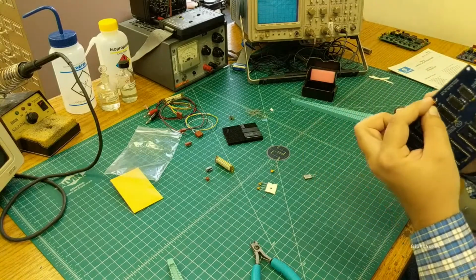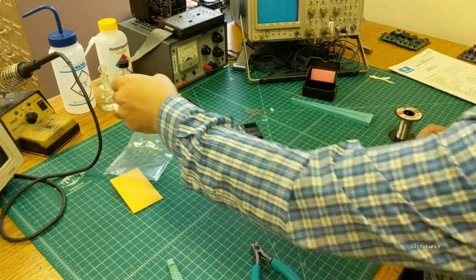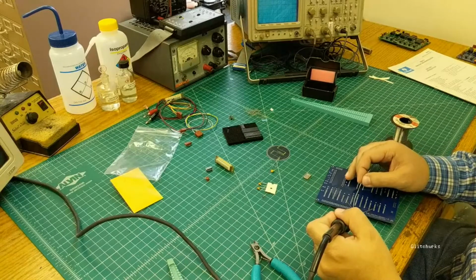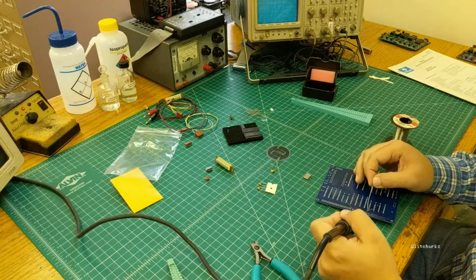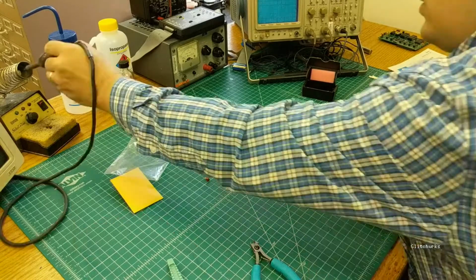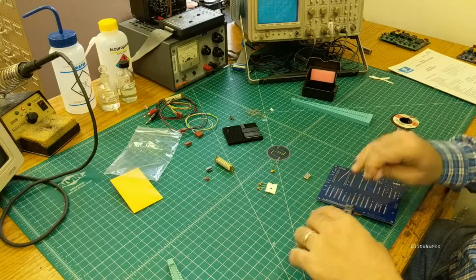And if you get the capacitor in backwards, it's ruined. Do not try to flip it around and reuse it. We've had a couple people at workshops do that and find out, yep, once you short it, that's it. It's done. And clip the leads off.